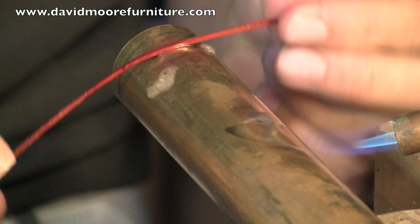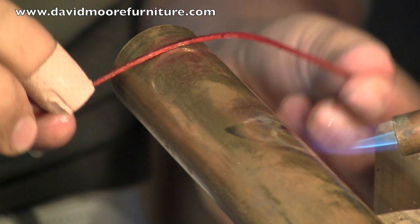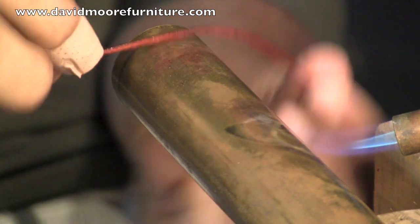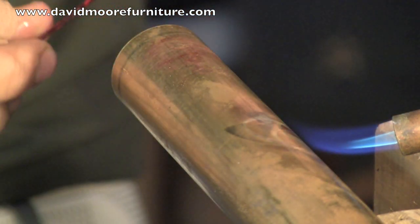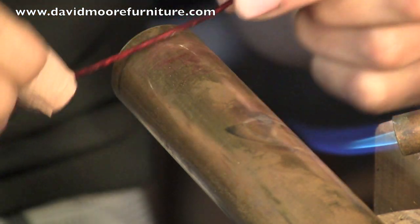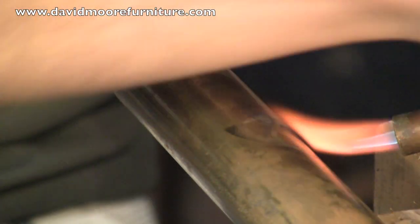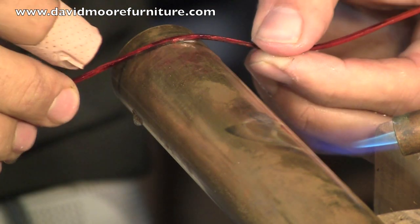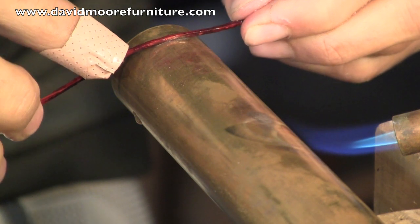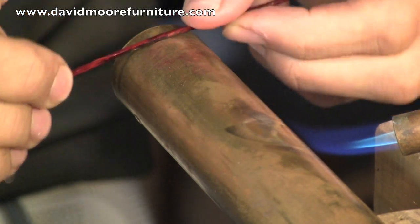With this pipe and flame, I slowly work the wet Padauk stringing into a complex curve. Padauk is brittle and hard to bend and will often break, so I recommend making a lot of extra material or choose a species that will bend more easily. I try to bend all that is required for the project while I have this set up, so afterwards I can begin fitting and mitering the parts.